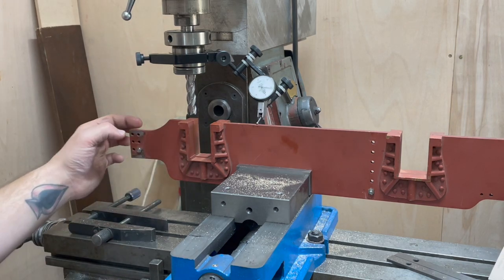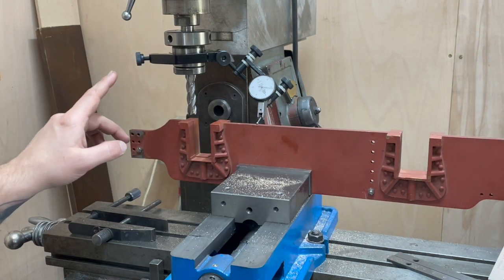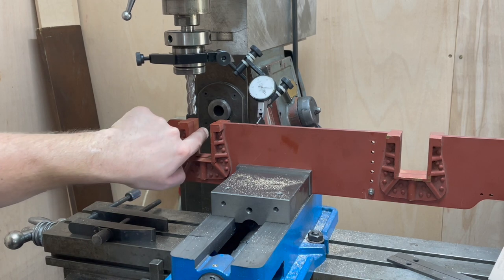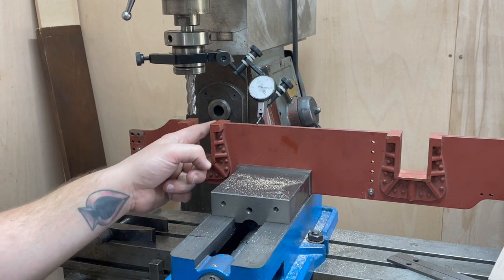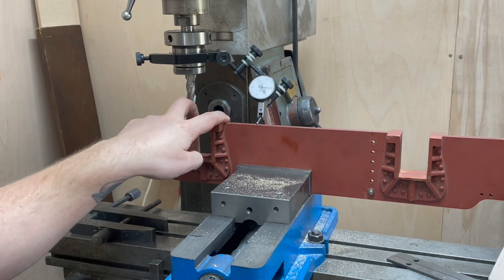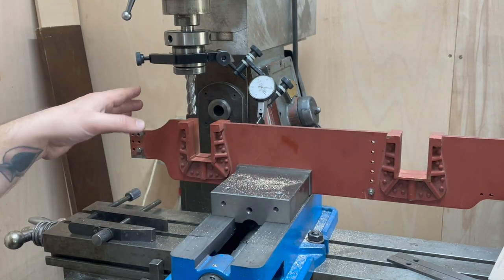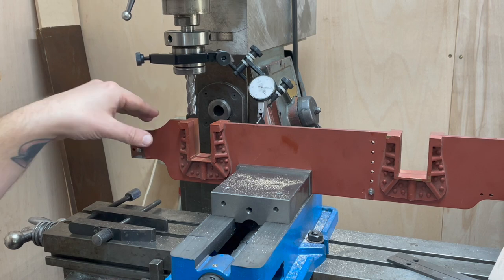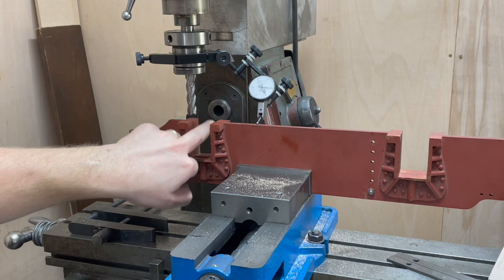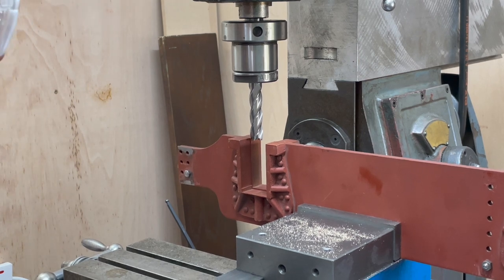The reason I'm doing this setup is because although these holes are perfectly matched to each other for the various features, the axle boxes are not. They are very slightly out — a couple have got a little taper to them and a couple have got a step. This one for example is about 30 or 40 thou narrower than the one behind it, and over here it's offset very slightly. So I'm using a brand new long series end mill to take some very light cuts, just back and forth to skim these down to be exactly the same width.